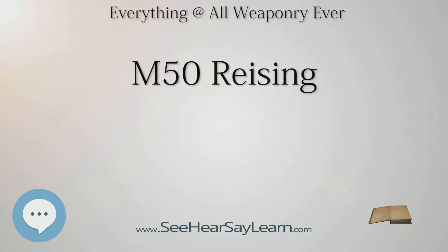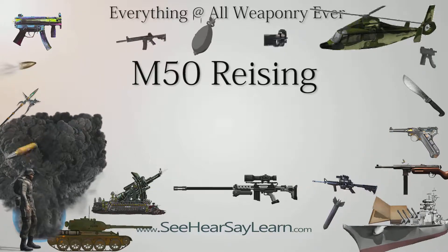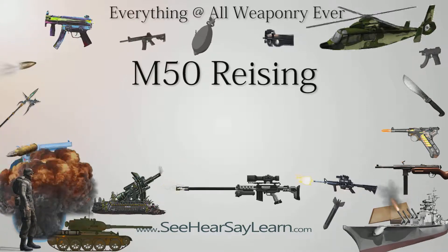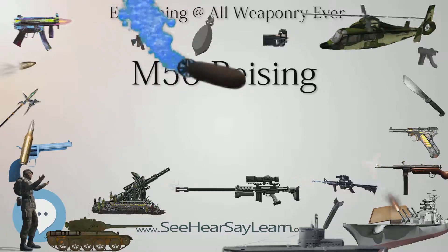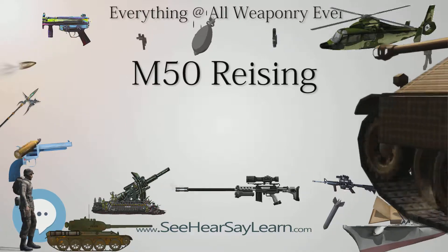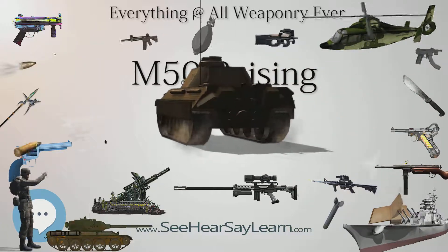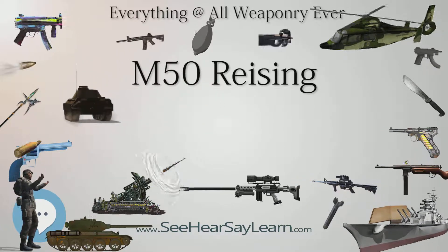This also allowed it to be lighter, as did its firing mechanism. Like the 1928A1 Thompson, its operating principle was delayed blowback, but the Thompson's Blish lock system was far less mechanically effective. Like a simple blowback weapon, the Thompson was dependent on high bolt mass — bolt inertia — to secure the cartridge when firing, requiring this component to be particularly heavy. The Reising's bolt is much lighter due to its delayed blowback mechanism, and consequently the whole gun could be correspondingly light without detracting from accuracy and controllability.